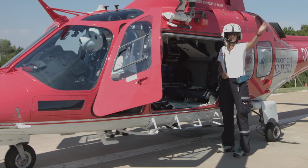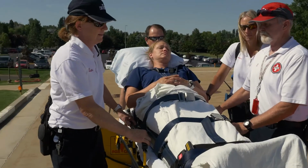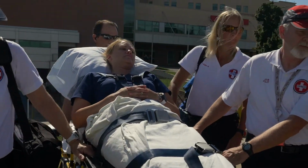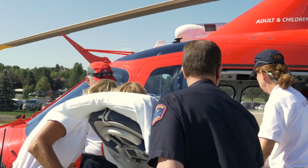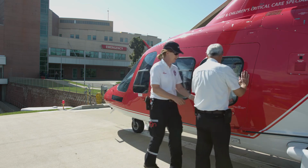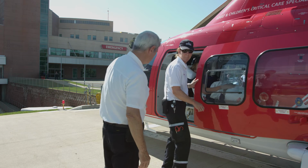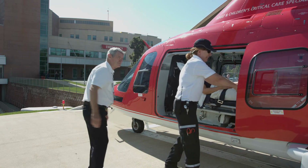Never approach a running helicopter unless instructed to do so by the flight crew. On the ground, the flight crew is in charge with respect to the helicopter. If you are asked to assist with loading, unloading, or helping carry gear, do so only at the direction of the flight crew. Do not assist in opening or closing aircraft doors. Damage to doors can occur with very little effort and can ground an aircraft. Flight crews are responsible for all operations of the helicopter.